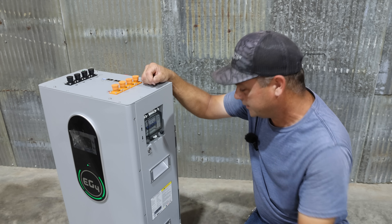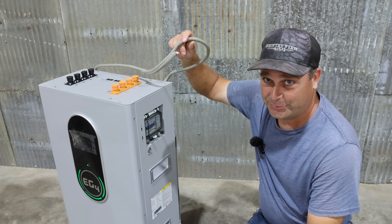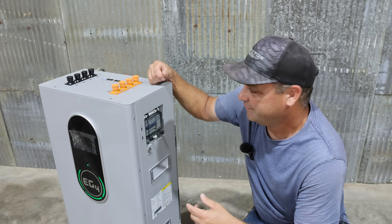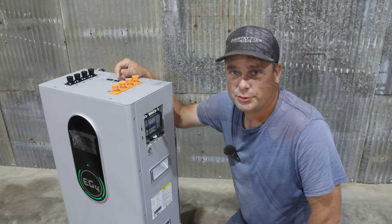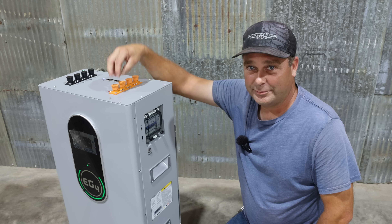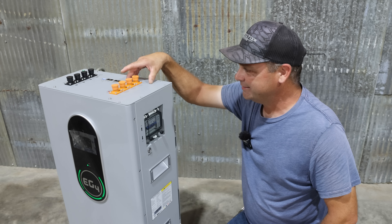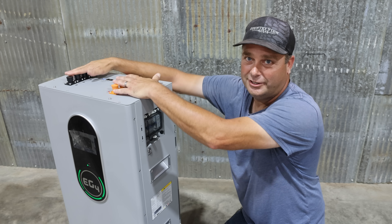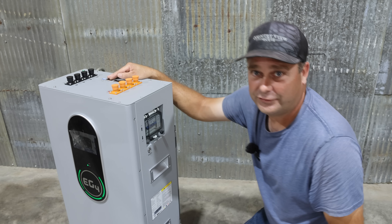Some things I like about this battery: it has its own circuit breaker on the side, lifting handles on the side, and ropes when it comes out of the box to help you get it out. This weighs about 280 pounds — it's a beast. You're going to need equipment or at least two people. On top you have positive and negative battery connections — 250-amp quick connectors, four on each side, attached to a 600-amp bus inside. You can connect three 200-amp batteries together onto this one bus.